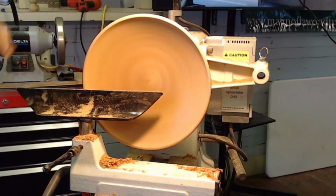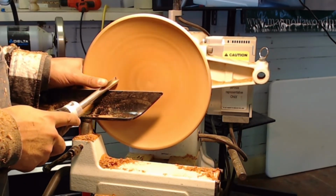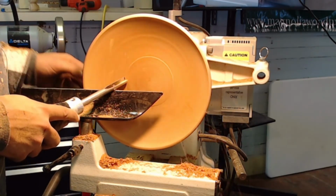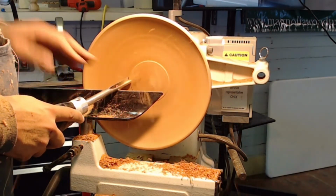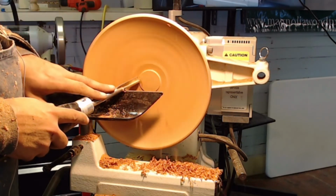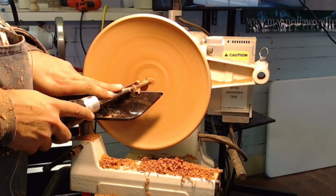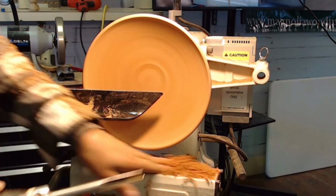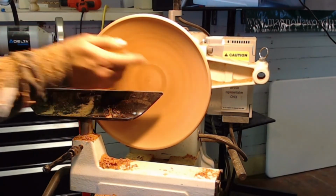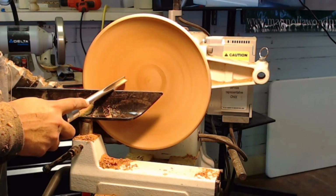There, nice little final shape there on that tool. 600 RPM. Now I can pick up the speed. The reason I'm making these cuts is to make sure that the interior is the lowest portion, and when I drag my hand, I don't feel a flat spot. It's got to be a nice full round interior. And let's see if I start up here. I'm going to go down again, slow it down.